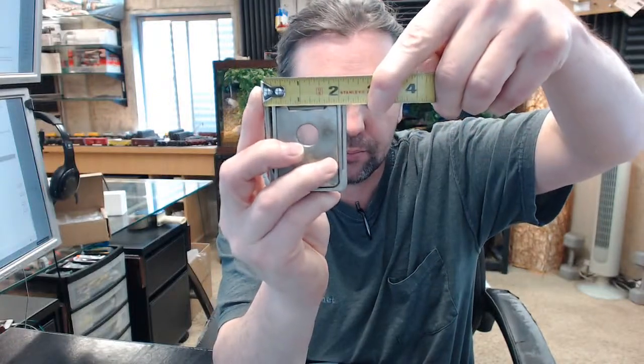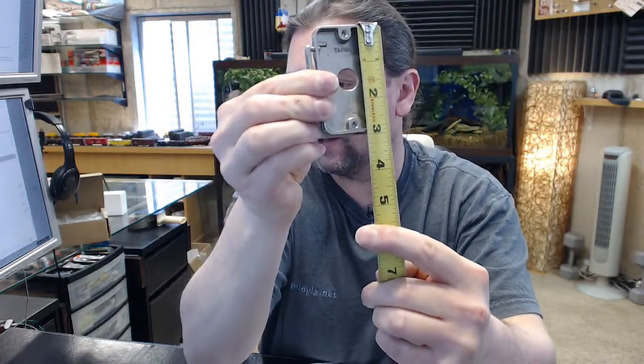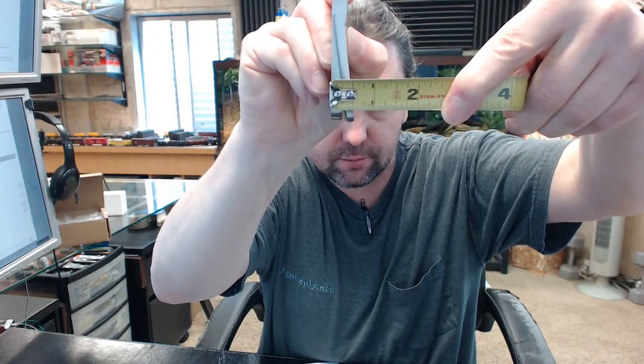There is a link below this video to a document called Tech Sheet, and that's pretty handy because it will allow you to review all of the dimensional properties of the item, and let's go over that now. Overall width, as you can see, is basically 2 1/8 inch. Overall height, basically 3 inch, just shy of that. Projection, they give it at just heavy on 7/16. I'm going to say it's closer to practically 9/16. Their dimensional drawing is not exactly correct, but it's quite close.